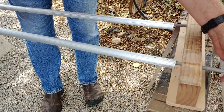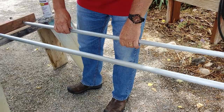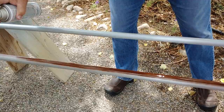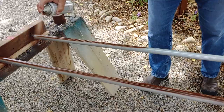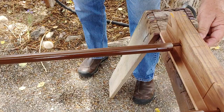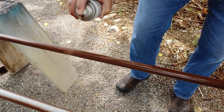Notice that we used a little jig — some barn spikes and small stanchions on the benchtop to elevate the work. I modified those so the nails would go through and I could suspend the conduit. Then I began painting. Notice that I don't stop unless the paint is off — you never want to stop while painting because the paint will puddle. I painted everything up and down and got a real nice even coat. To rotate unpainted areas into accessibility, I just used the heads of the barn spikes. Once they were all painted on that warm summer day, we let them dry out there and get good and dry before handling.